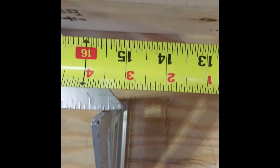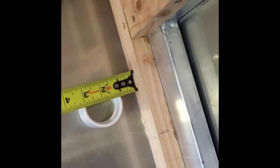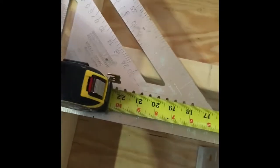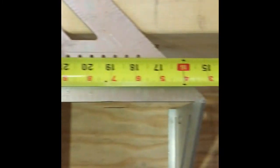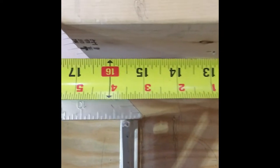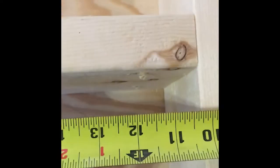I want to be 15 and a half off of the side wall. The reason for 15 and a half is because there will be a half inch of finish on the walls. I've got a big square and I've got it lined up at 15 and a half. Where those two lines intersect down at the bottom, I'm going to make a mark.